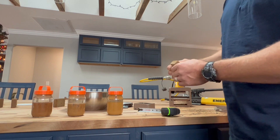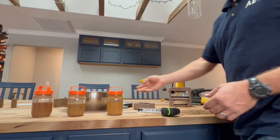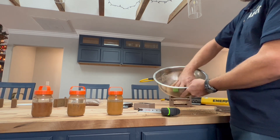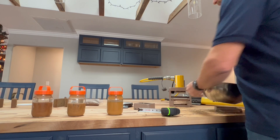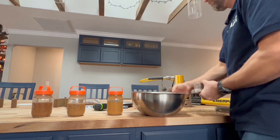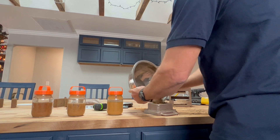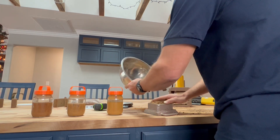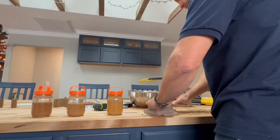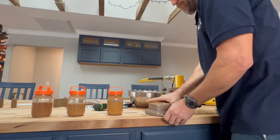In this scenario, the customer is thinking of doing 8% cement stabilized blocks, so with one of these samples I've put about 8% cement in, mixed in, and got the right moisture. Now I'm going to make the first of several small sample blocks — just to demonstrate how this device works, I put the soil in the little breech and get it roughly level.